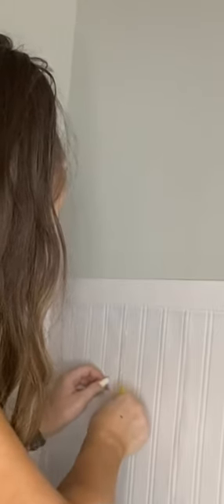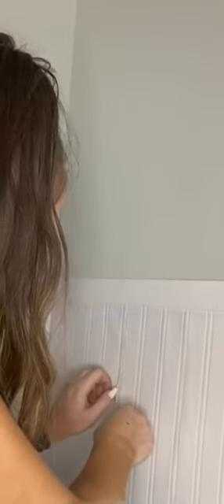Under the flaps I put this wallpaper adhesive, and I put it on both sides. Once you put that in, it helps keep the wallpaper in the new position you want it to stay in without the air bubble. Then I used the same smoothing tool from earlier on top of it — now that there's also glue — and that helps lock it into place.